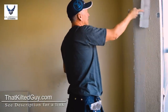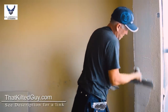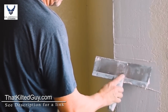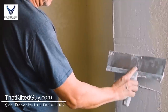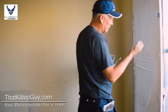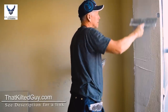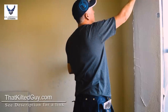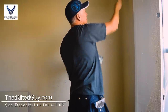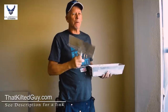See that chatter mark right there? It appears to be a nail sticking out — yep, one little nail. A little bump on the wall will do that too. That's basically it — that's all we do on this coat. We're going to let that set up, then come back and put a coat of regular all-purpose joint compound on it.